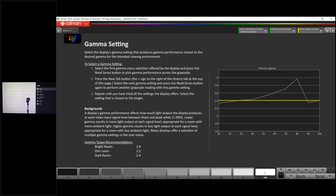We're gonna go into the menu, and I believe this was under advanced or it was under calibration settings, one of the two. Yep, calibration settings and then gamma calibration. So here we go. At input level 65, we're -5. This makes sense. Why does it make sense? Because 65 would be right here. It's way too dark, and the gain control is at -5. So last time we turned 65% down 5 clicks. This time when we measure that, it's way too dark. So my next prediction is the levels from 50 to about 80 are all going to be down in the negatives as far as the adjustments go.